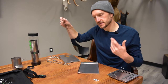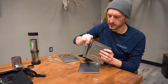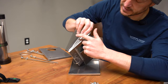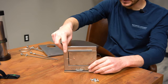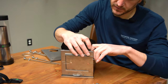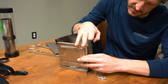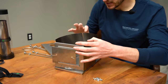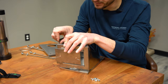Typically what I want to do as I set this thing up is I'll just set the bottom piece out, take the front part, and slide the front piece into the receiver. You can see there's a little groove right here in this side piece that just slides over the front part of the stove. I'll set that in and then wrap this around and install this front piece right here in the opposite groove. It can take you a second to get used to putting it together, but as you burn this thing in, it's actually going to take shape on its own very quickly and easily. The first time it's a little bit awkward, but not too bad.